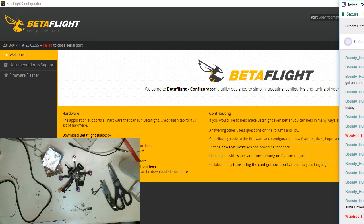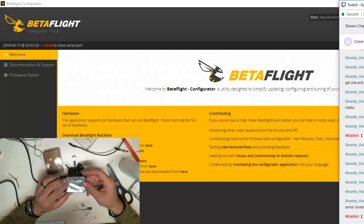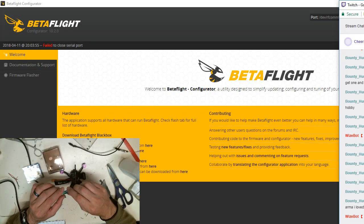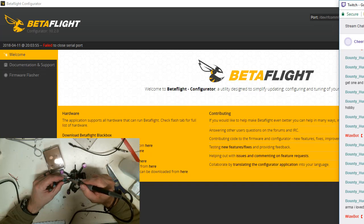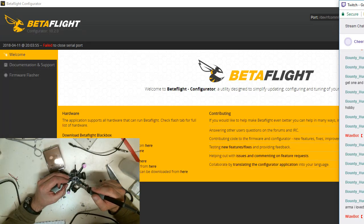It's the wiring diagram. That's the other cool thing about this hobby, is that you've got to get back into doing this stuff. So I know the square, so the power is the middle one. So we're going to take red to the middle. We're going to take the blue, which is the S-bus, which is the standard transmission, I guess, for my controller. Okay, so now we've got the transmission wire set.